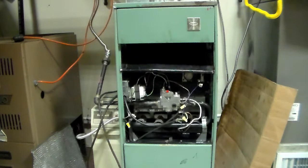Things that would cause spillage: number one is lack of combustion air — if the unit's in a small room without enough air, it'll suck air back down the vent to feed the burners, and without enough combustion air you'll get flame rollout. Number two is a plug in the vent — birds get in over summer, build a nest, and when you go to use it in winter the vent is blocked. Number three is wind causing a backdraft, which you can't do anything about.